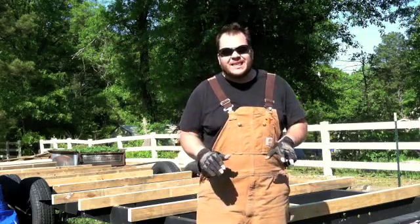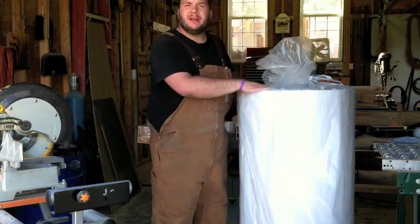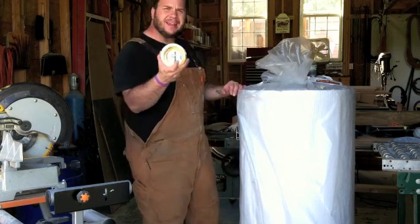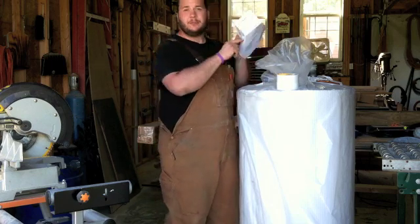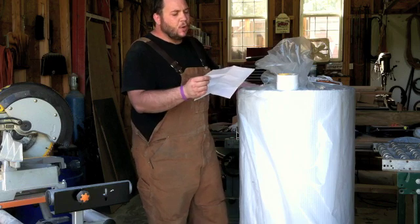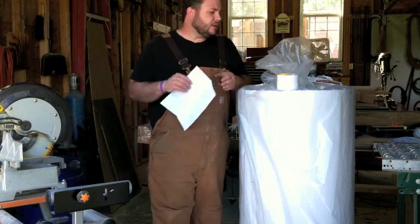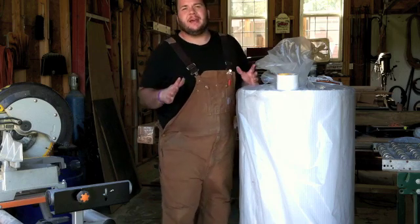We're about to lay down the Ecofoil radiant barrier. This is the product that was shipped to us — came in a thick plastic bag via FedEx, along with acrylic adhesive poly tape for taping the seams. This particular product is a 48-inch by 125-foot double bubble foil insulation with a white UV-resistant facing. We're going to put the white side down, parallel with the ground, and the aluminum side facing up so we're utilizing the barrier as best as possible.